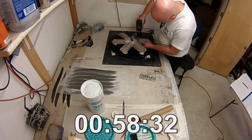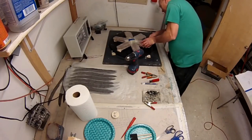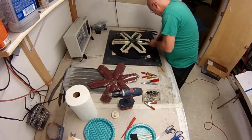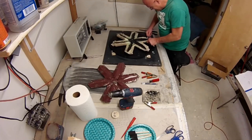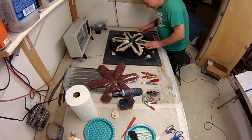I used 8-32 screws to hold my molds together. You want to let it cure about 24 hours before you pop it apart, and basically the prop ends up being completely kick-ass when you're done. It is hard to get out of the mold — you've got to take your time and really work it.